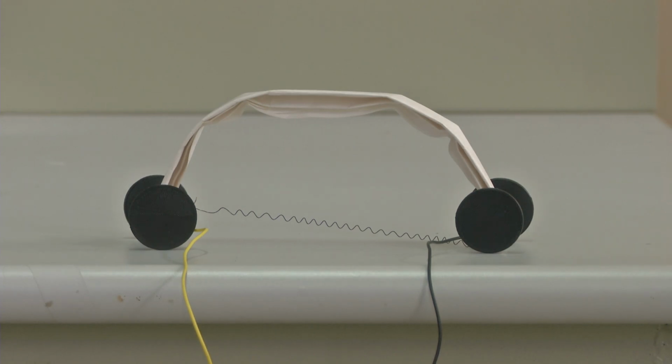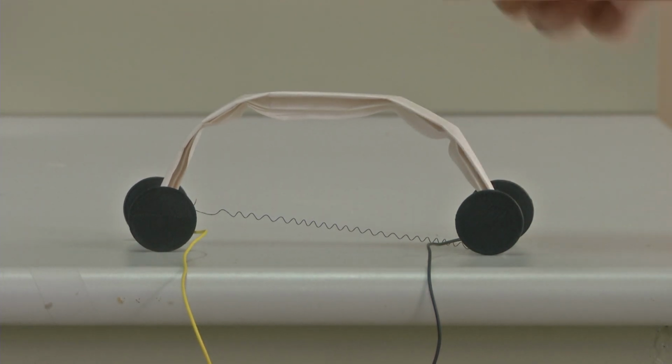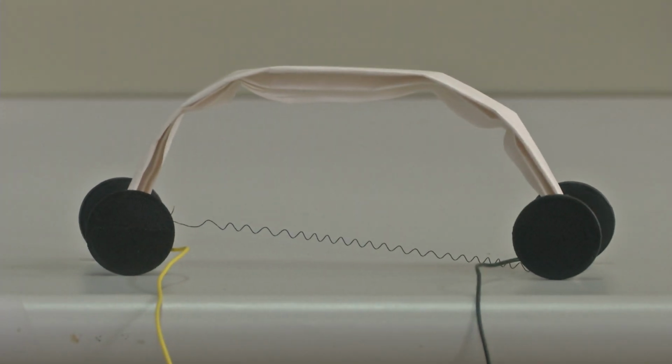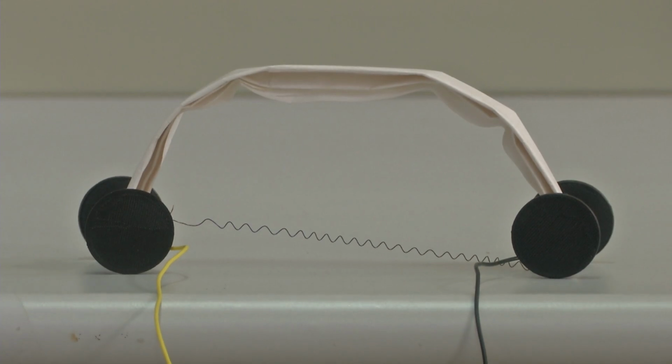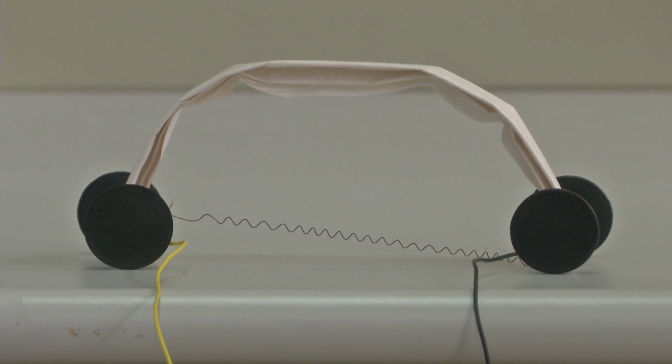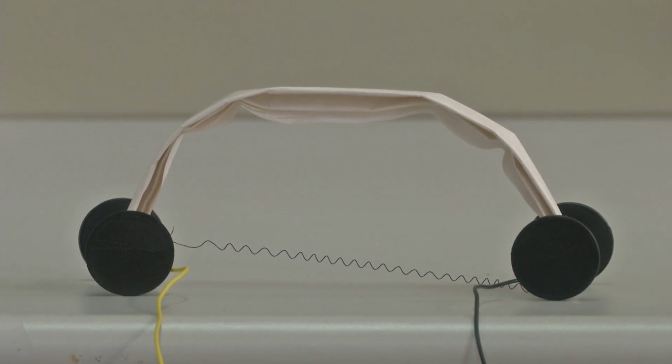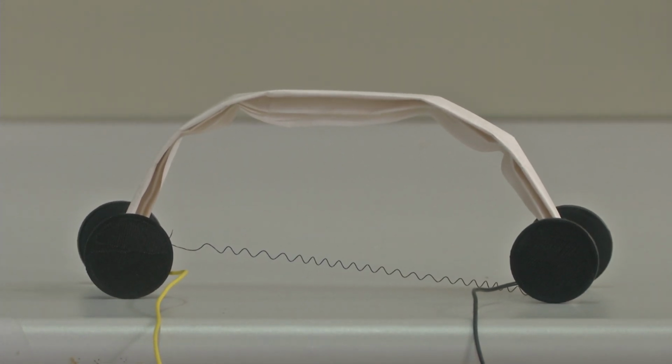He's just made this prototype in like 10 minutes. He's just taken an SMA wire, trained the SMA wire like we've shown in the previous video. So that is a trained SMA, and what we have here is just a 3D printed prototype of a wheel structure. Now he's using a source supplying a small voltage to the shape memory alloy.